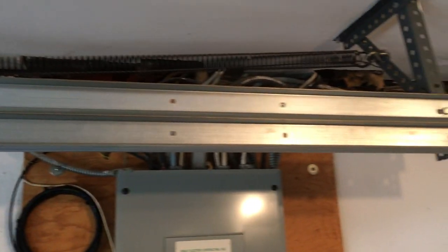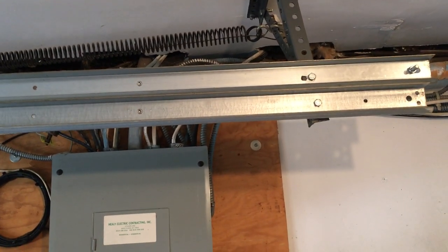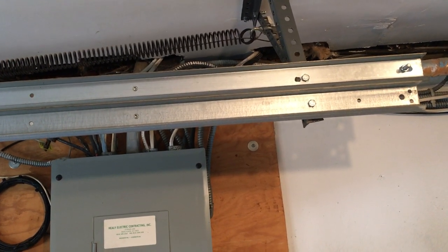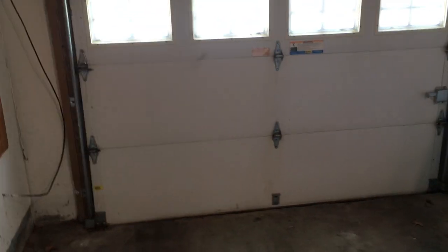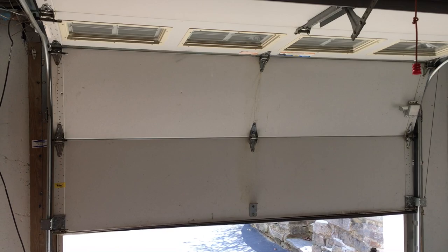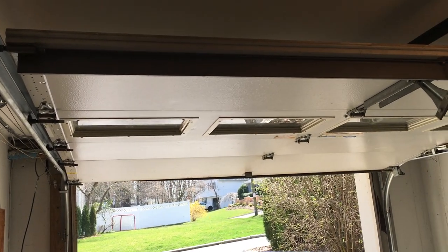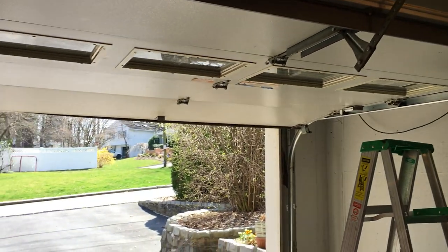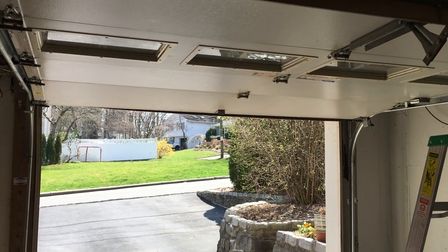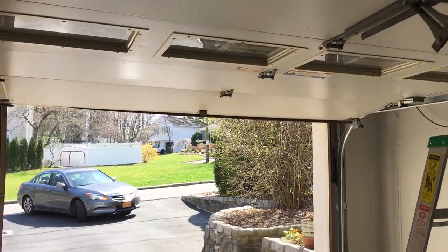I'm showing you the right side of the door, but it's a symmetric problem — you only need to do the calculation once. The entire load of the door is shared left and right, so you're pulling up on the door with roughly equal forces on each side. The same mechanism balances the door and prevents it from rotating left or right as it opens. The only way to get the door open with the motor and slider system is to balance the forces and moments with the left and right tracks, so all the motor's horsepower goes into opening the door rather than causing friction or jamming.